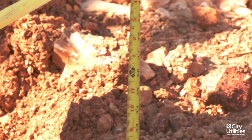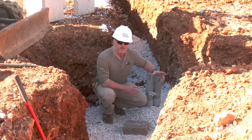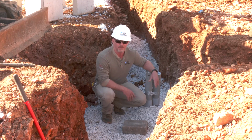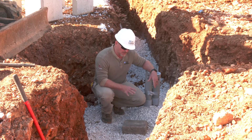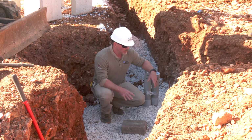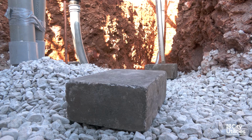So you may be wondering why we have these paver blocks in the corners here. This is for settling purposes. These are quite heavy. We don't want them getting out of shape once the things around us start moving. Even though you have backfilled and will continue to backfill with 1-inch clean rock, we're going to be using 4 of these pavers, 1 in each corner. In our 3-phase vaults, you'll see that we actually use 12.